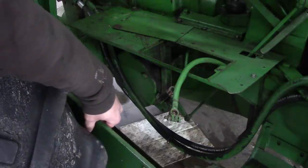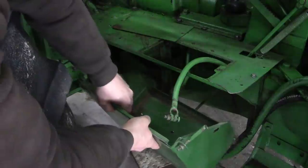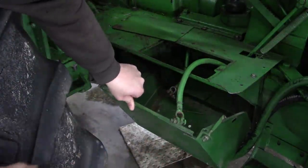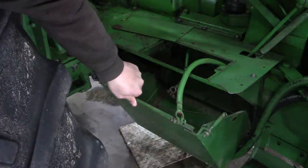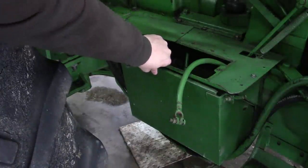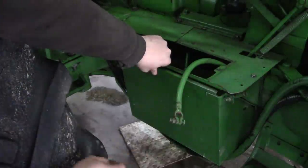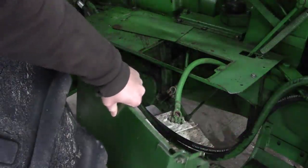Here we go. On these Oliver tractors, the batteries mount underneath of the platform where your feet would normally sit while you're driving. And they sit inside these two battery trays. There's one on either side, and the trays kind of tip up like this, and then there's a couple of bolts here that hold the whole tray back against the bottom of the platform here. I've already removed the batteries, obviously,